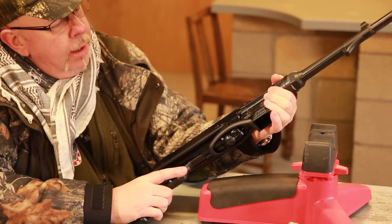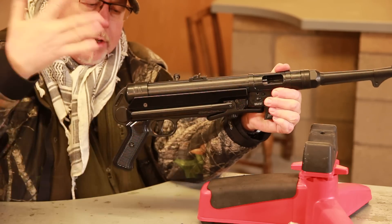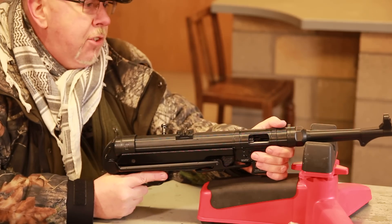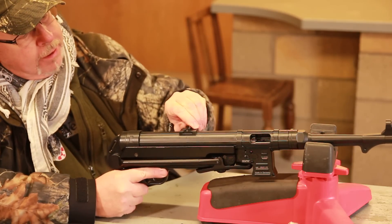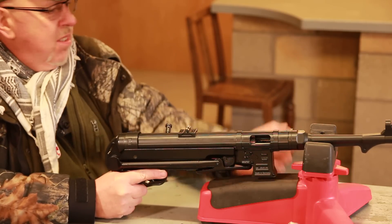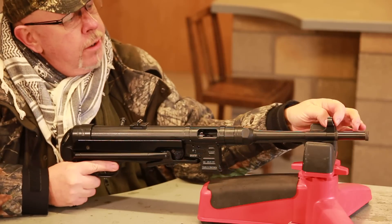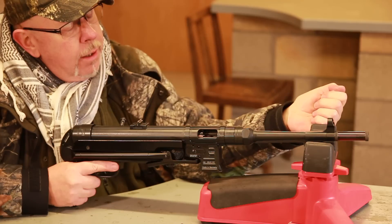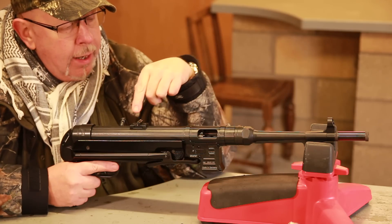Stripping — I won't do it as it takes too much time — there's an Allen key in there and you back out the grub screw; the lower part of the receiver pulls back about half an inch and drops down. Sights are very basic, as befits a machine pistol, because it's just a spray-and-pray gun. The rear sight is a fixed blade for probably about 100 yards and a flip-up blade notch for 200. Up front, you've got a hooded front blade on a little tiny ramp, and GSG include four more replacement blades of different heights and thicknesses so you can zero, to a degree, as you can on the back.